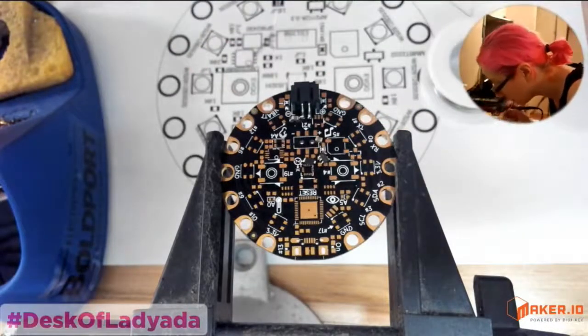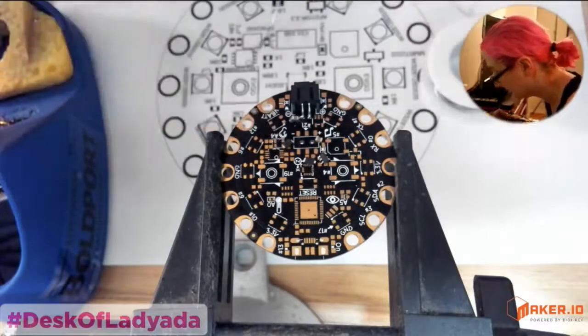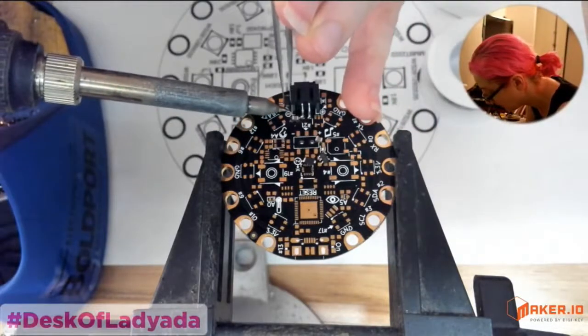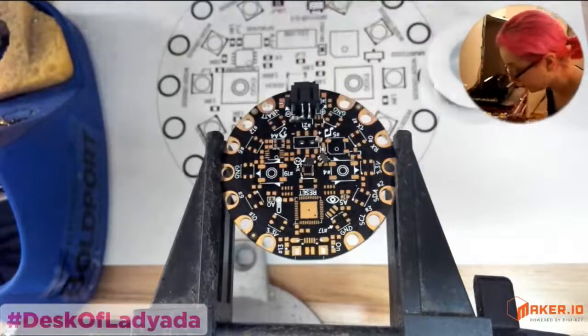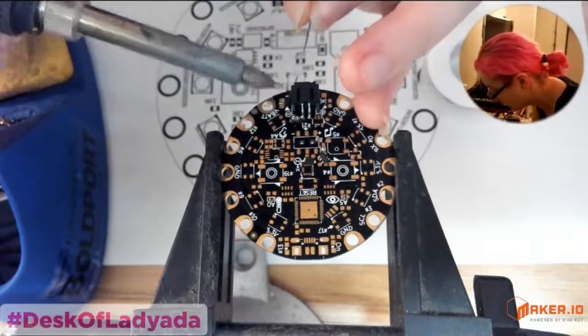let me just get this diode polarity right. You just buy parts that are RoHS, and if everything in your design is RoHS, then that's it, you're done. Okay. So when you go to websites, DigiKey specifically, they indicate if it's RoHS or not. They do, and also there sometimes are variants of parts, so just make sure you get the variant that is RoHS.